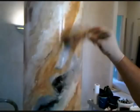On this particular pillar or column, we did not add any brushed veins and move those brushed veins around with the eraser tool or the wipeout tool. We had done several other pillars in the house, and I wanted these two pillars at the library, they're shorter, to be uniquely different than the other ones. So we did not put any cracks. We decided to use ribbon veins on this. And so I'm just simply badgering what I've placed now, kind of softening and blending.